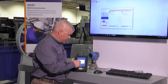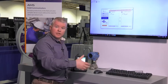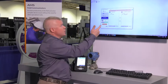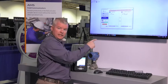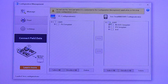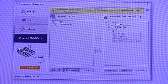There's also a way to transfer configurations from one Trex to another to help co-workers or other people who have other Trex units, and that is with the configuration management software and application inside of Windows. You can see here we've connected our Trex, and here we can see the HART device configurations that are available — the test one I just did and the previous two templates.